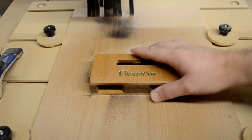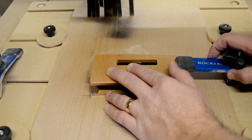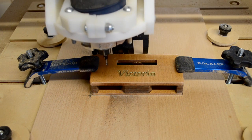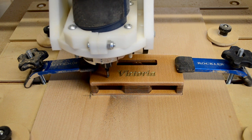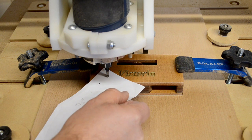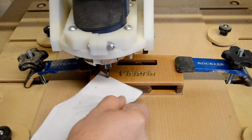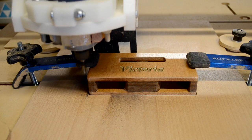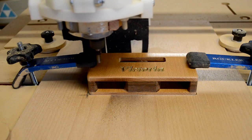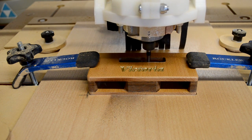I've now created a fixture that my part can be located onto and secured in place, just as I set it up before actually cutting the pocket. Without changing the X and Y zero points, the Z can be reset for the new operation. A touch plate makes this quick and easy, but I don't have one so I just use a piece of paper as a feeler gauge, stepping down one thousandth of an inch at a time until the Z is set where I want it. With everything set up, I can simply run the secondary operation in complete confidence that it's going to cut exactly where I want it.